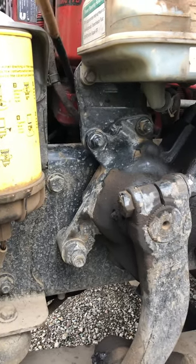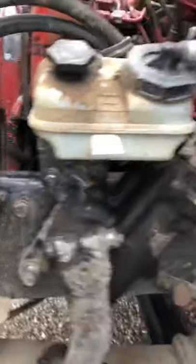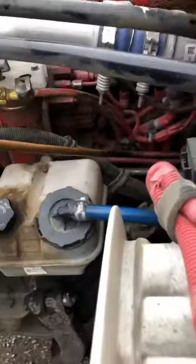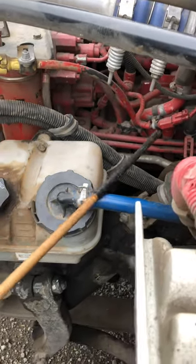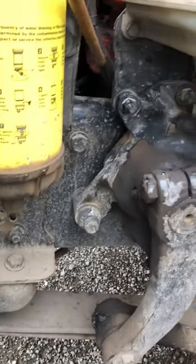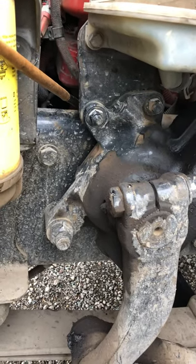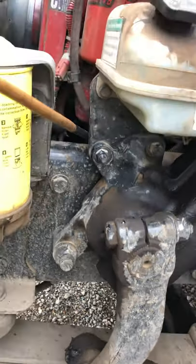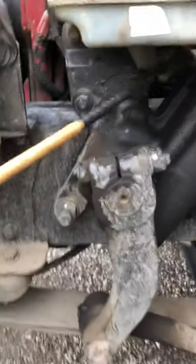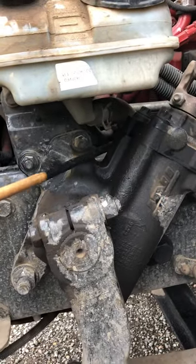The governor on this truck is on the other side. After that, we check the air compressor hoses. They should be properly mounted and secure with no bubbles, no cuts, no tears, and no leaks. Then we check our power steering pump, which is under the air compressor. It should be properly mounted and secure with no missing bolts, not cracked or bent, and no leaks. The power steering pump hose should be secured with the clamp with no bubbles, no cuts, no tears, and no leaks.